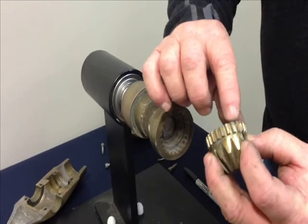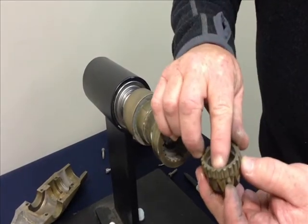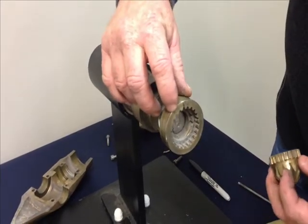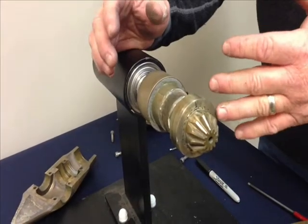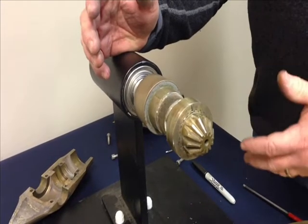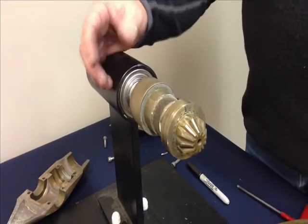So we know where our mark is here. The tooth is one, two — two steps away. So from K, we're going to N. That groove is set into the letter N. So we know that the letter settings are: X equals N, the single dot equals D, the double dot equals S, which is 22 degrees right hand rotation. That way you know how to put it back together.